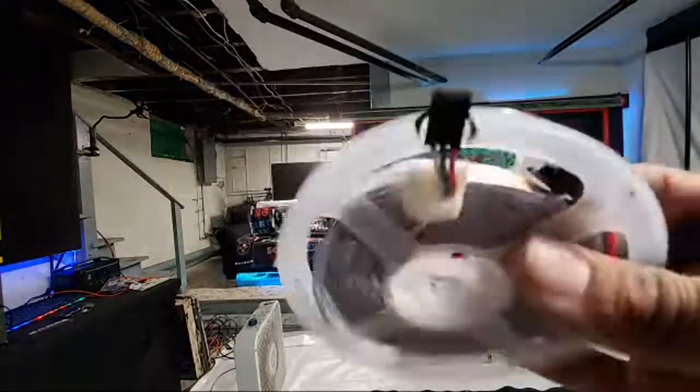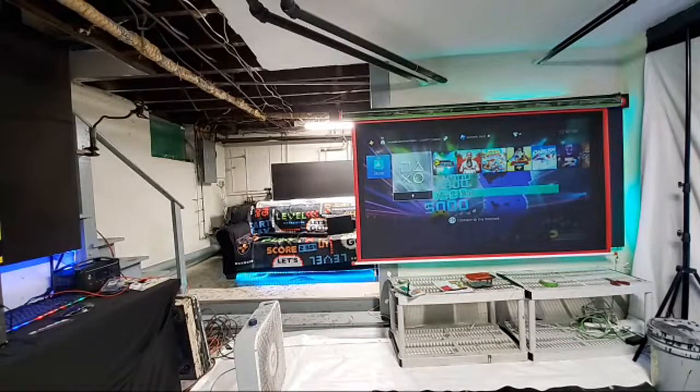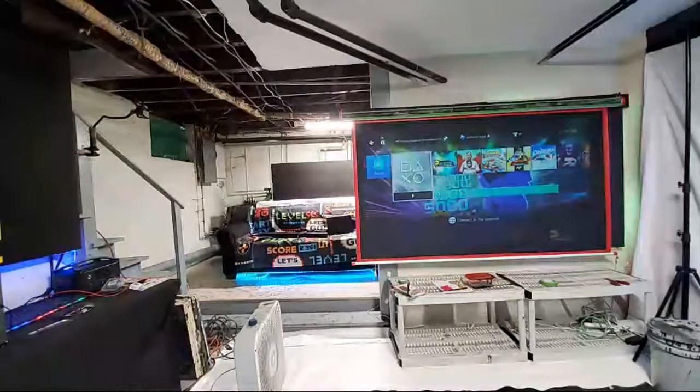These connectors are a little different for the chaser. This is how the chaser's connectors look. They're a little different. These are designed to be daisy chained. And also, like I said, as you run these through, keep in mind you can only run about 3 of these before they start to go dim. So, about 6 of these.